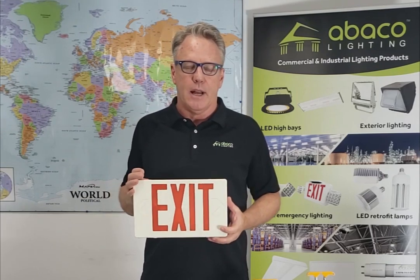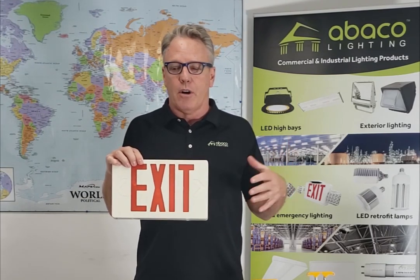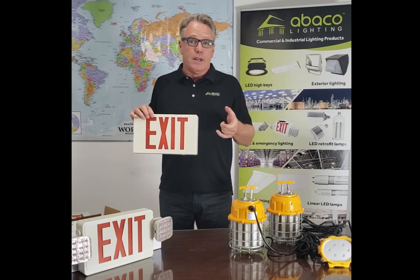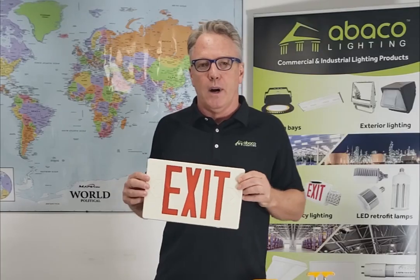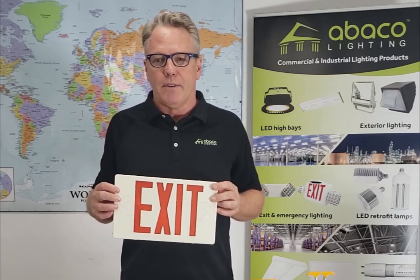All of our exit and emergency lighting, whether it's just a standard exit light, an exit emergency combo, or an emergency light, or even if it's an industrial emergency light, washdown emergency light, explosion proof emergency light, all of them are LED based now. So the power consumption when you're in an emergency situation where the power's gone off and you need these lights to light up requires less battery. So now we no longer have sealed lead acid batteries that need to be checked every couple of years. All of these are NiCad batteries, 25-year life, so a lot more robust than the product that was available just 4 or 5 years ago.